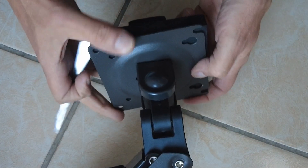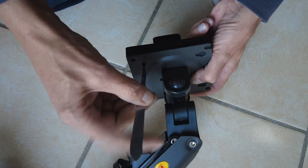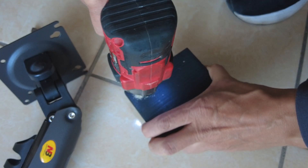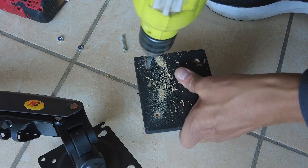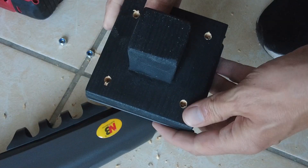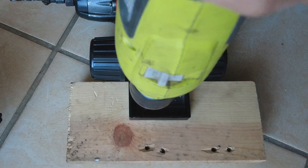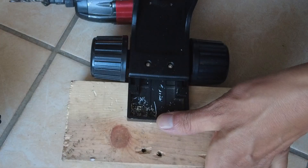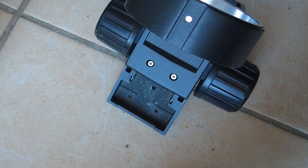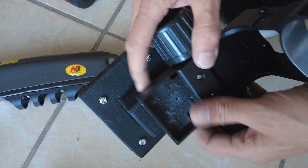Mark the vessel mount hole positions with a scalpel blade. I'll drill some pilot holes with a small bit and then I'll drill the correct diameter for the clamping bolts. Next I drill three holes through the microscope holder back plate at the bottom. These holes need to be within a 4.5cm square and to match the position of the adapter block behind the plate.